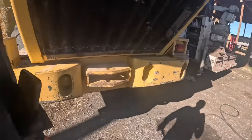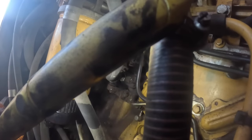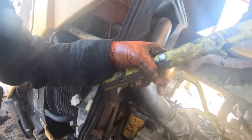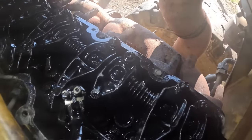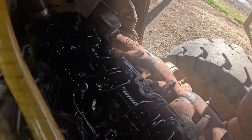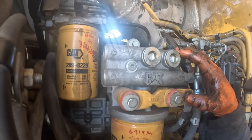These 6.6s on these loaders, they get a toggle switch here — you can manually prime. There's a transfer pump on the back of the main pump that pumps in your fuel. This is just a priming pump. Let's climb up and make sure the valve bridges didn't move — they're really temperamental. Everything looks good as far as I can tell. That big cam Cummins — that injector stuck and took out the cam. I saw the push rod was bent and I was like, what caused that? Once you pulled the injector link out, it was stuck — you could see where the plunger was stuck down in it. Piece of junk remanufactured injector.